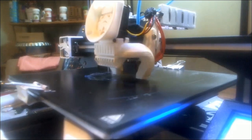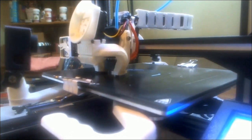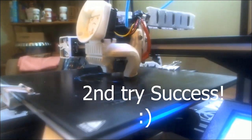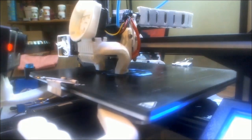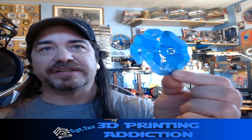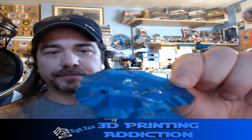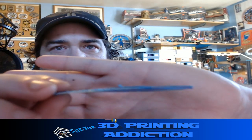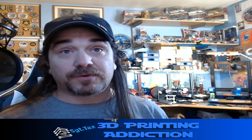The second attempt I could tell right from the start exactly where I wanted it — a nice, halfway smooshed into the plate, halfway above, just a nice bead. Very successful, and a lot quicker than the four-point leveling I had to do before. Here's my first layer print — that's the way I'd like my first layers to be. You want enough thickness on the plate, and it works out rather well.